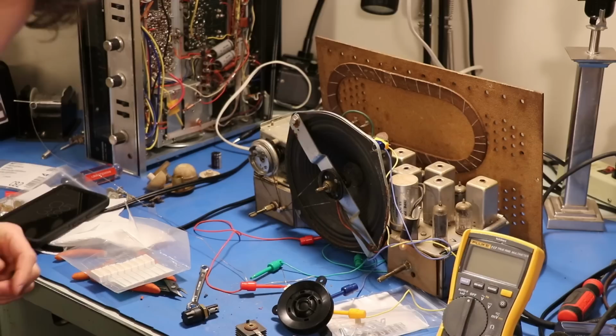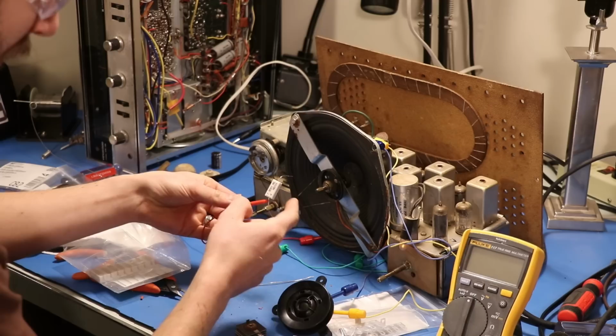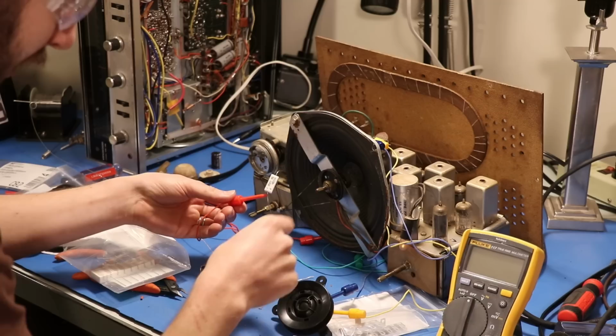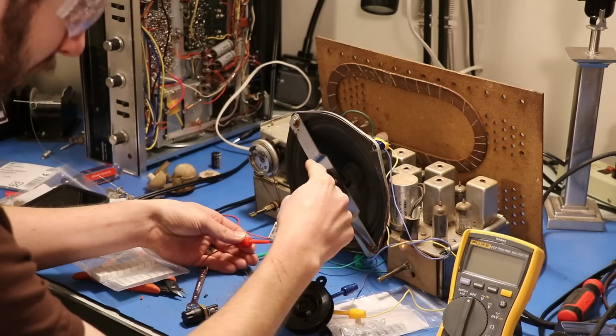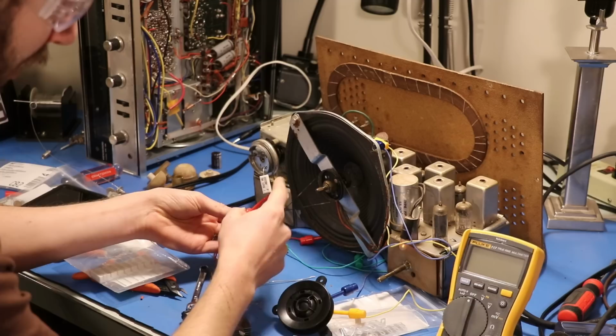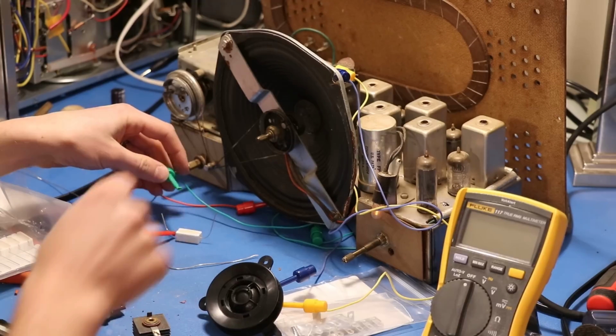All music is copyrighted on the radio for the most part, and I can't find anything that's for sure not. But I was talking about this resistor earlier. I've got a 100 ohm resistor in series with the diode for replacing the selenium rectifier. I want to show you what I'm hearing, just in static, and I think you'll be able to hear it. We saw we're supposed to get 125 out of the selenium, but we only get 110 with the 100 ohm resistor. So if we put one in parallel, bring it down to 50 ohms, I want you to hear the difference. When I clip this green lead here, we're going in parallel underneath. Just listen to the static, just listen to the difference.